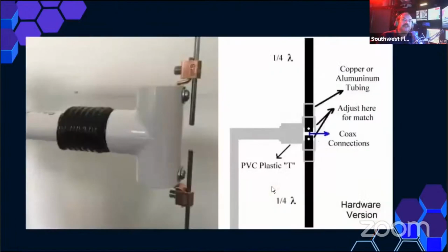All right, this shows you, this is a little fancier. This guy found some pieces and put a little bit of a fancier connection on there. That's also pretty cool. The wiring's down inside, and then he brings it out for the coil and then back in again. This is a little fancy, but a great setup there. And once he cuts it, he can do a little bit of tuning there as well, because the gap in between is not as important as the tuning length. But it does become important if you get too much or not enough gap in here. All right, so that shows you that.